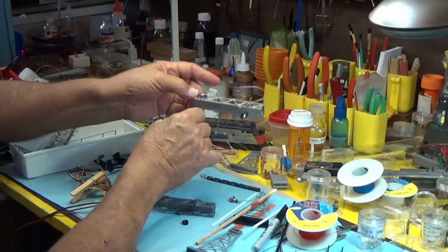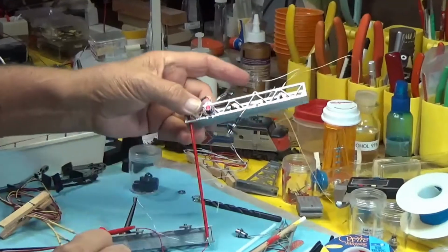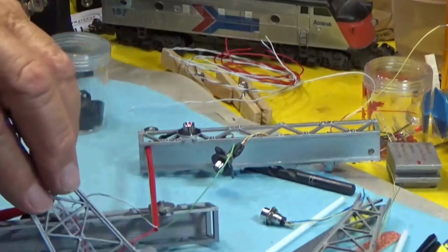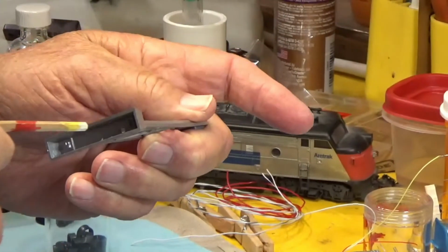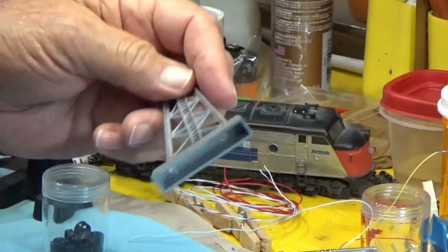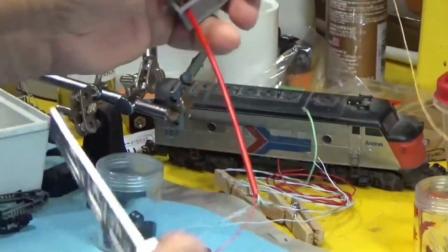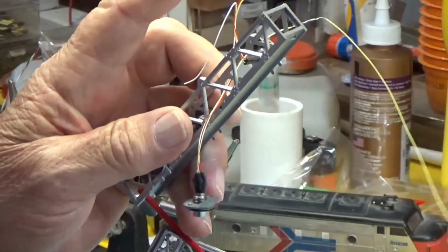The way this works, we fed all the wires down through the tube. The tube will fit right through the hole that we cut. We cut another hole the same size in the tower supports. There's the hole. It's easiest to drill in from the bottom. Use a small pilot drill, and then enlarge it out. Again, this drill bit's going to grab and it's going to want to twist. And these are fairly fragile, so you can, I suppose, have one twist off. And when you get them matched up, the stirrer tube will go through that hole, so we can see that.